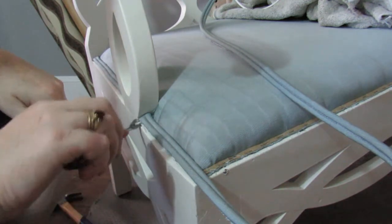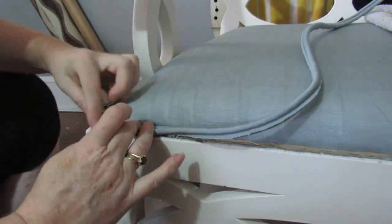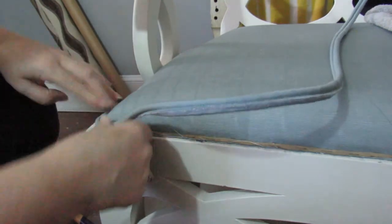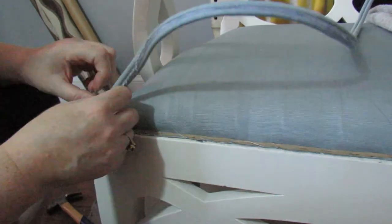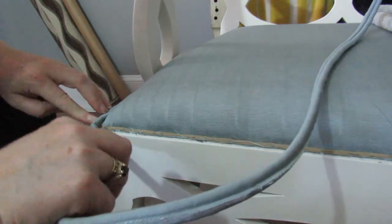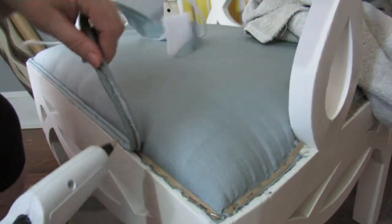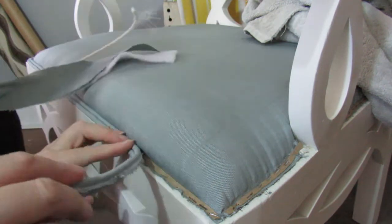I'm going to just scrape that off using my tack remover. I need to bring this around - I need to see where it's going to settle. It's going to come around here and I have all of this showing under here - I can't have any of that showing. So pull that back and trim anything that's going to show, back as far as you can, especially the card. I've got the card hidden and then I've got to work on the fabric - might be able to get the fabric to glue when I put it in place. I'll take a little bit more back on the card, then put enough glue to get me to about there, come around, sweep that fabric up and in, and push it down and into place. I'm going to work my way all the way along the front of the chair, which of course is the easy part because it's nice and straight. I tend to put it on both sides of the seam - I always sweep it in from the side so if there's anything I want to hide it's taken in and then down, and press hard.